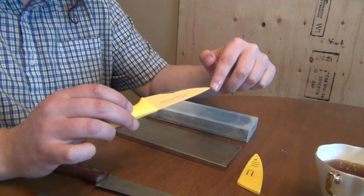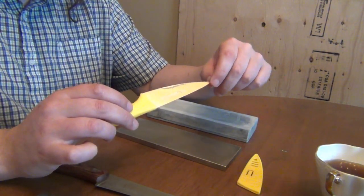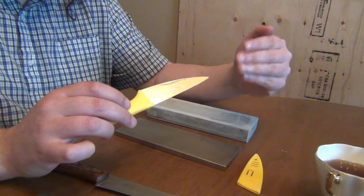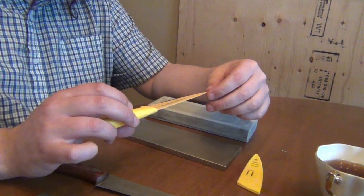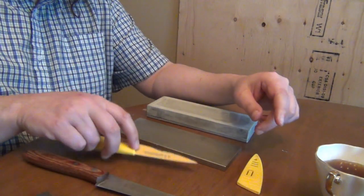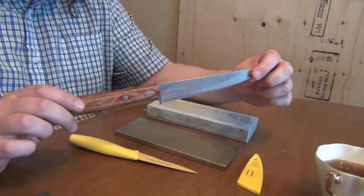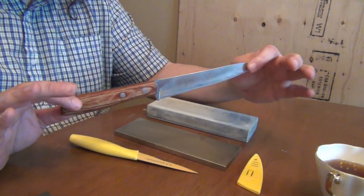And when I straightened out one of the tips, it cracked off, not a good sign, and it revealed a very coarse grain structure that I could see by eye, not a good sign. So then I was wondering, what would the edge retention be between this and this, which is a utility knife from Spyderco in MBS 26 at around 60 Rockwell.